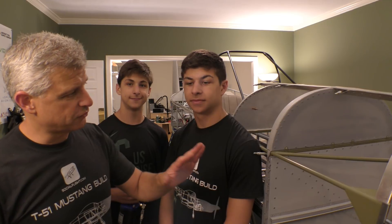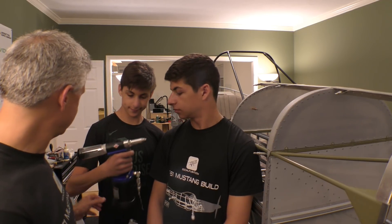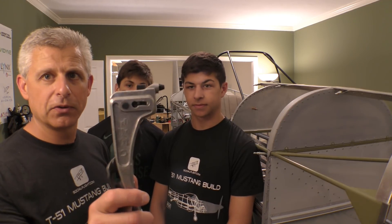We finished the forward side of the Station 3 bulkhead. This was the first time we worked with the adhesive and put our rivets in for final time, and we're working against the clock — we learned a ton. We learned we can't get that much done in one shot, and you need to check in advance what the rivet gun can fit. The pneumatic rivet gun from Aircraft Tool Supply is amazing, but it doesn't fit all tight spaces, so we also used this super tight-space rivet puller from Aircraft Tool Supply — the original pop riveter — which came to save the day. We know what we're doing now and are much better prepared to finish the rest.